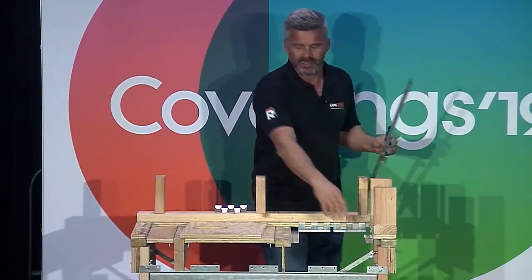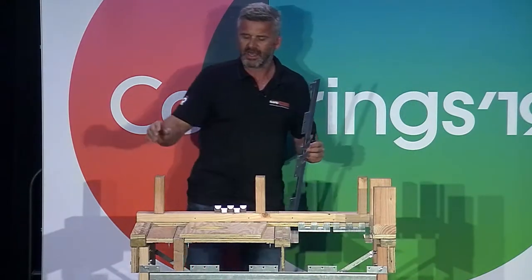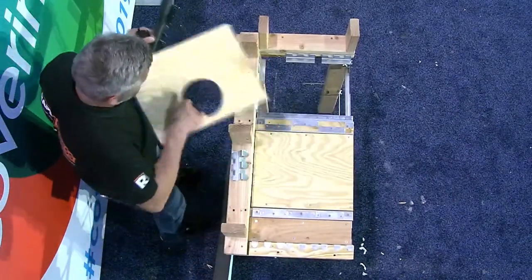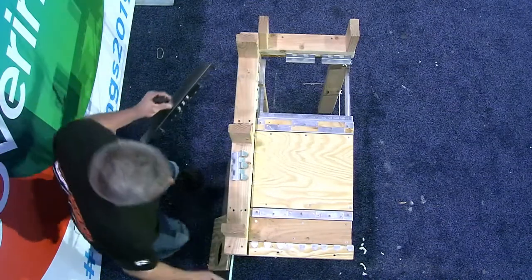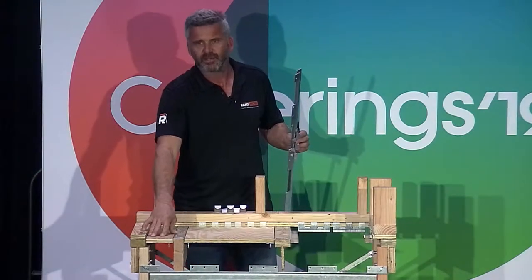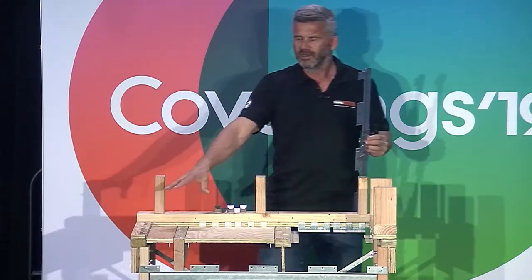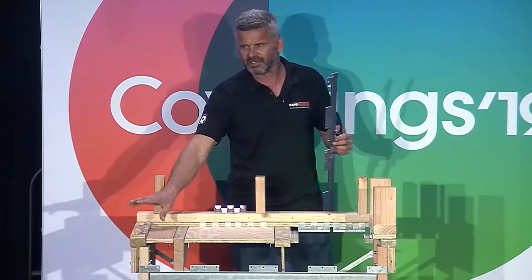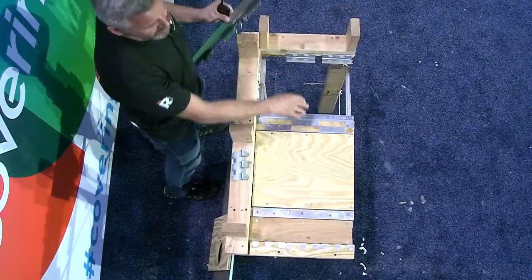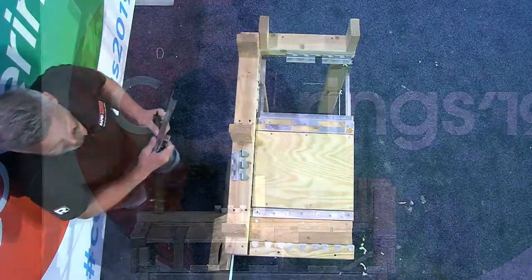Here are the steel brackets and here is your original floor of the bathroom. Now you have a step of 11 sixteenths of an inch from here to the top of the recessed floor. That gives you enough elevation difference to create a pitch from the outside of the shower into the drain without any step whatsoever — completely flush tile at the entry to a shower.